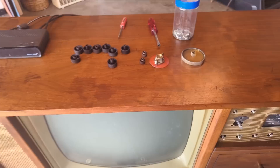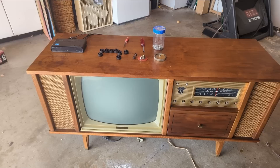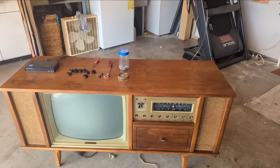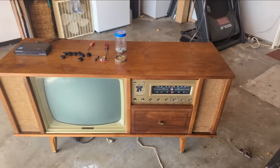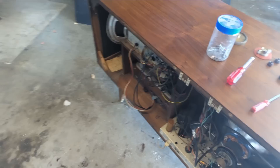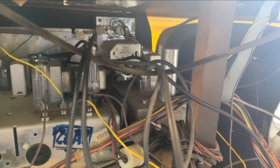A lot of television sets in the earlier 50s, maybe even early 60s, had a piece of tempered glass in front of the CRT. They hadn't quite figured out the implosion technology yet, so if the CRT did implode, it wasn't a bad idea to have safety glass in front to contain shrapnel. I've removed all the knobs because the next stage is taking out the tuner and amplifier chassis — they're built into one unit — and there's also a multiplex adapter that needs to be overhauled.